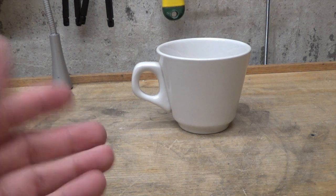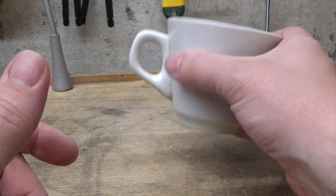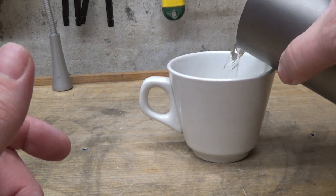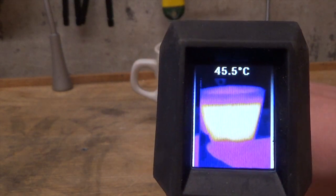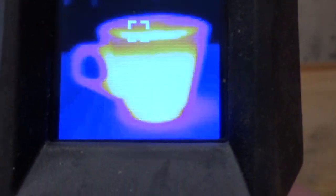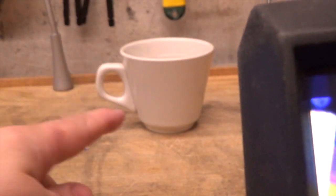What's special about that wavelength range? Ordinary objects at ordinary temperatures — like this tea cup — glow in infrared light at room temperature at around 10,000 nanometers or so. If you pour some hot water in it, it's now going to glow at roughly 8,000 nanometers. Let me demonstrate that this coffee mug is actually glowing in infrared light by throwing it on the infrared imager and turning the lights out. Notice there's no change in the image — that infrared light is actually being generated by that coffee cup.